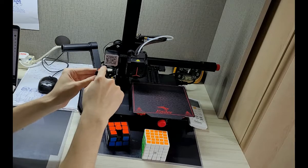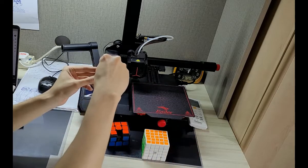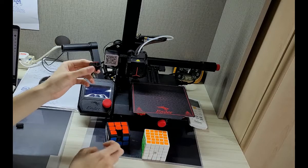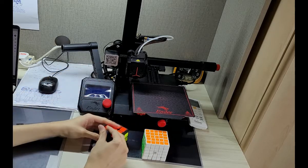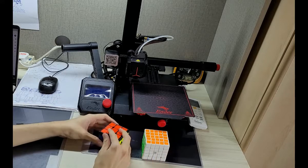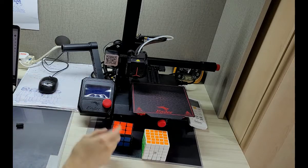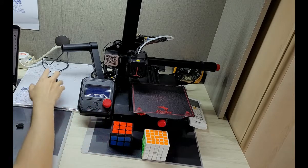The roof of the piece is also an overhanging part. If your piece is hollow, the middle of that roof is also going to be printed on top of nothing, so you need to put a support material there. In this case, it's a specific class of material known as the infill. It adds weight to the puzzle, and you can actually choose zero infill, but once again, the roof may not print properly, and at the same time, you may also weaken the piece with less material strengthening it on the inside. So even when I hollow the piece, I don't completely hollow it. I still put a little bit of support bridges inside.